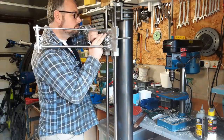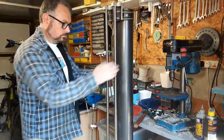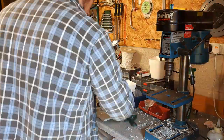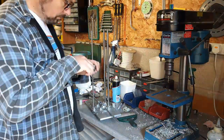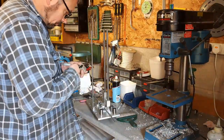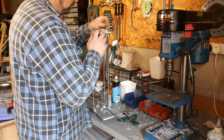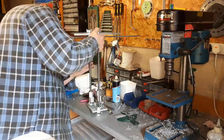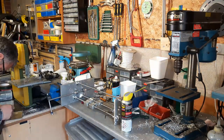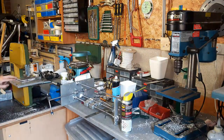This is pretty much where we left it off in episode six. I've just taken the radius axis off again and getting rid of that lead screw so I can get in and work a bit better on all these bits. So one of the first things I need to do is put the linear bearings on. I did take the ball bearings out and put in some plastic bushings because I thought they'd be tighter tolerance, but it turns out they're too tight tolerance because of the way this has been made by hand. The bearings wouldn't actually slide freely the full length just because the rails were not quite 100% parallel.